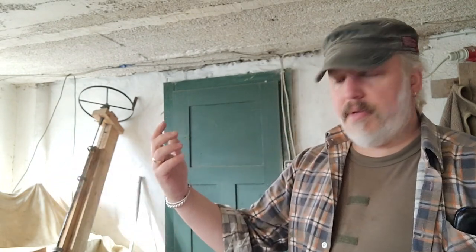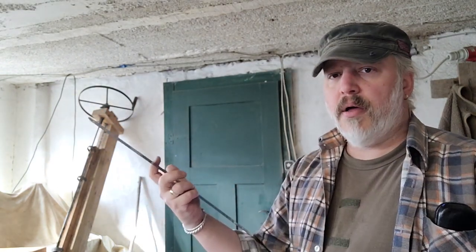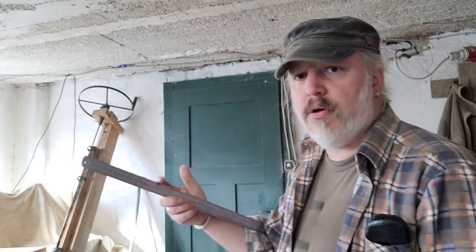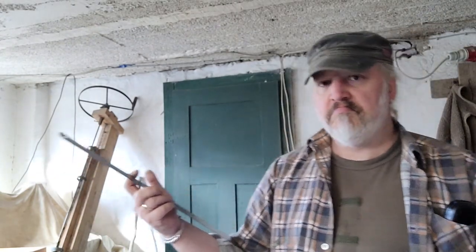At first, before we start, we need one really necessary measurement. That's the length of pull. That means you take your arm, elbow 90 degrees, put the measuring tape in the elbow, bend your trigger finger, and then you will see exactly we have 34 centimeters. That's the length of pull. So we need to fit the drawing to this length of pull.